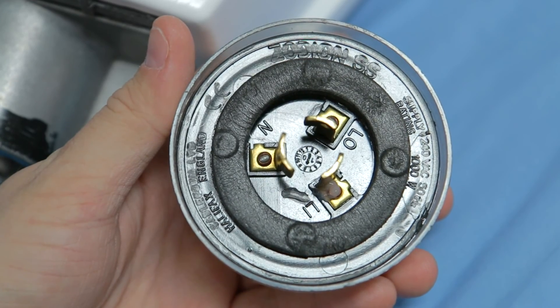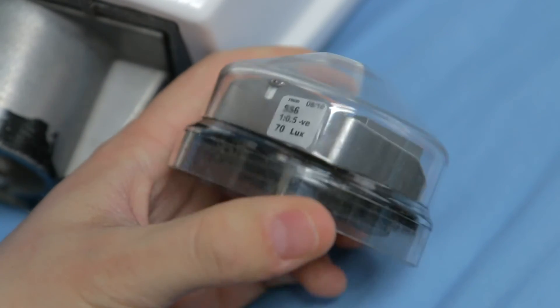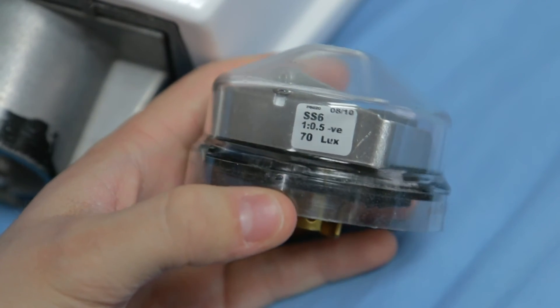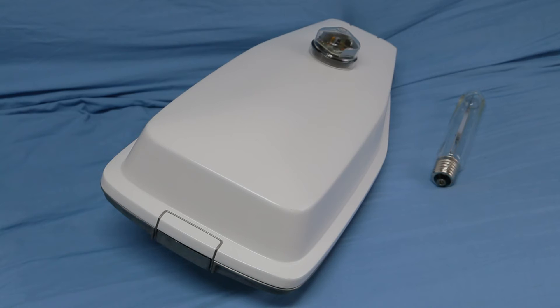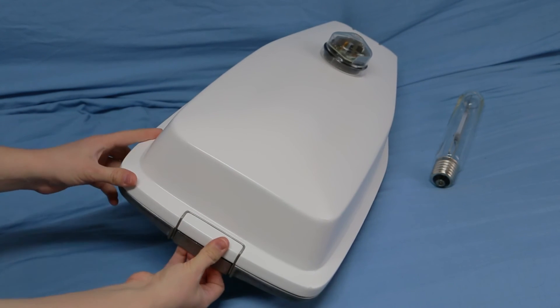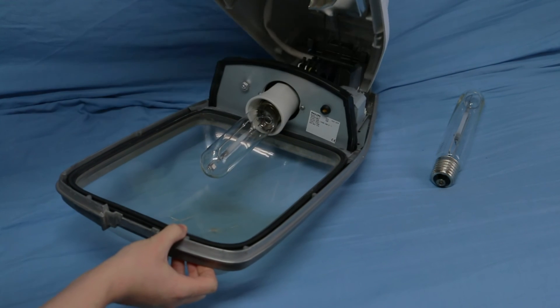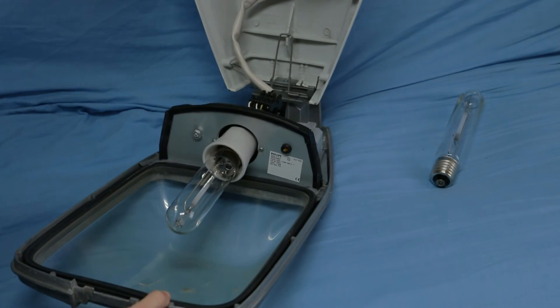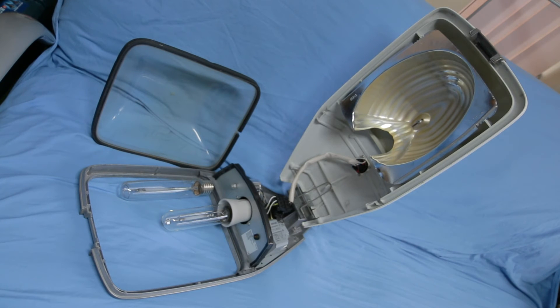These photocells are available in a variety of ratings — from 70 lux down to even 20 lux. Some of them are microprocessor controlled to enable part-night operation. Now we can have a look inside — the front catch is a bit stiff, but it lifts up and should lock into place. There we go. There's the canopy locked in the maintenance position.